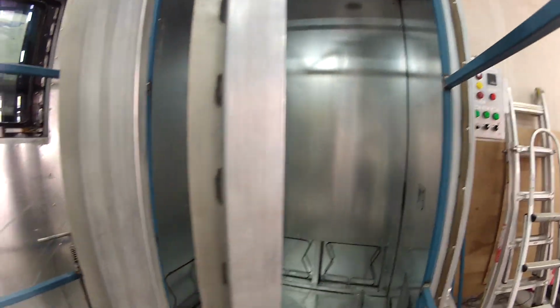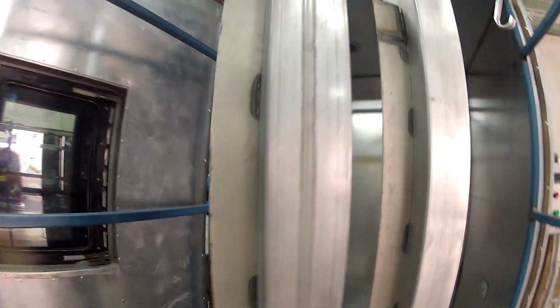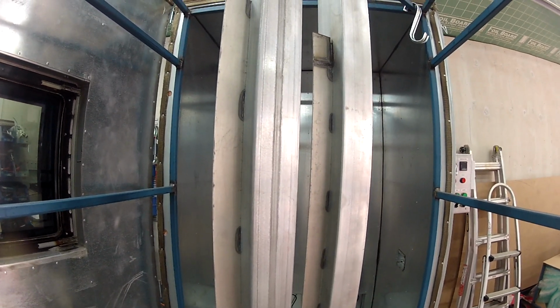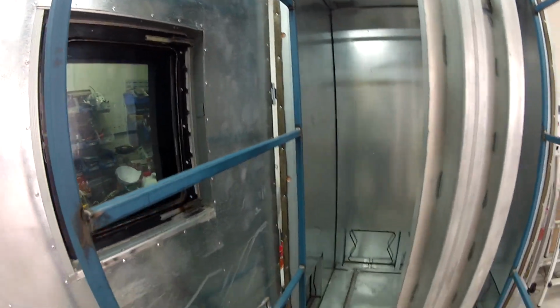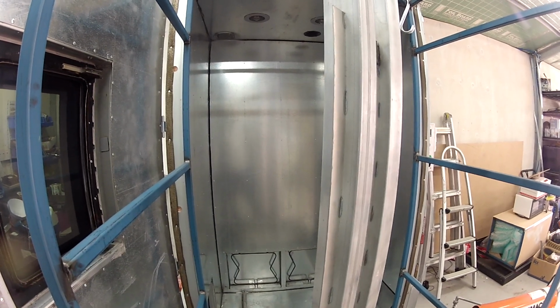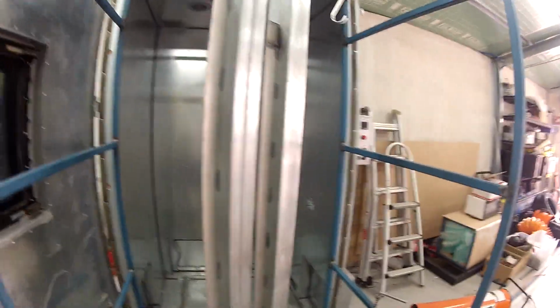And yeah, anyway, these were galvanised steel, and I've just TIG welded a little tab to them for the palings, and I've given them a very light sandblast, and now I'm just wiping them down with some acetone over there. We're going to pop them in the oven to preheat the metal and burn off any impurities, and then we're going to put a zinc primer coating, and then a top coat over that. So we'll see how we go. Like I said, never done it before.